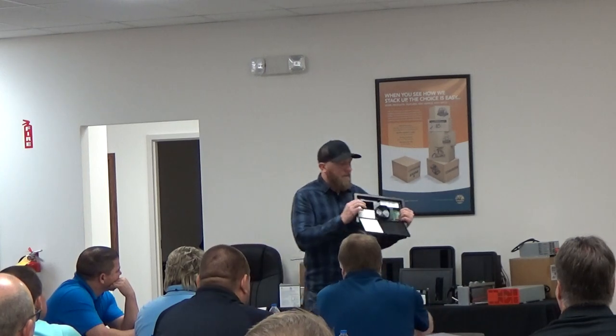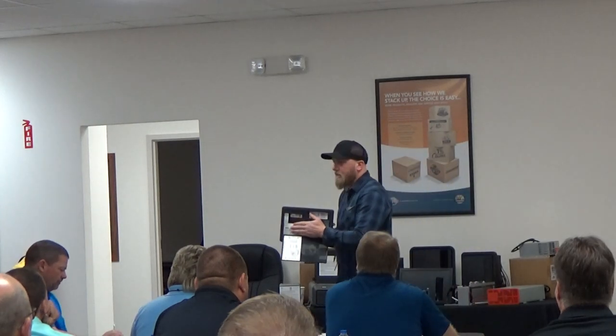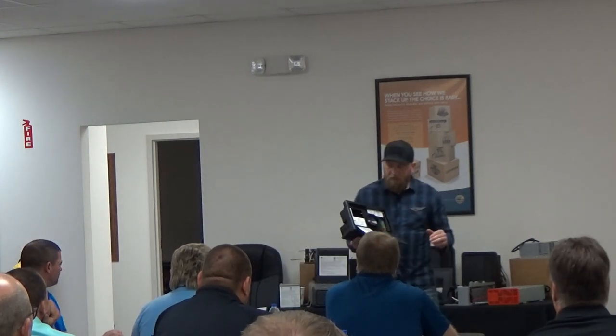Again, I'm going to repeat myself on a lot of things. With our fans, they're load based. So again, on the 8700 model, it's going to be a lot lower start point for that fan to kick off. And then when we move over to our DC fuse board, we have LED blown fuse indicators. You can't see the light, but right next to these fuses over here, when there's a fuse blown, you will have a light that illuminates and indicates you have a blown fuse.